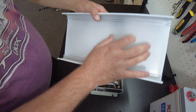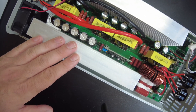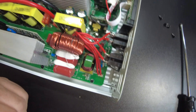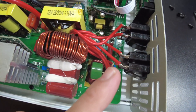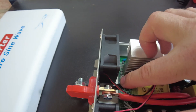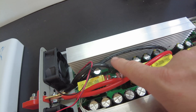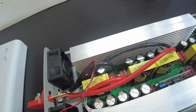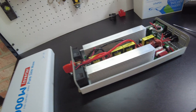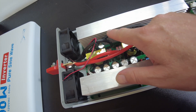Opening it up, the lid is aluminum. The guts of the inverter look pretty clean and tidy — nothing that looks like a mess. The solder joints are nicely done, there are 80mm fans, nice beefy heat sinks, and everything's tight on the terminal lugs. Inside, they've got two 8-gauge wires for the positive and two 8-gauge for the negative. 8-gauge is capable of 50 amps each, so we're talking 100 amps total — but this is a 2,000 watt inverter, and at 2,000 watts we're going to be pushing 200 amps, so I'm curious how well these cables will handle that.